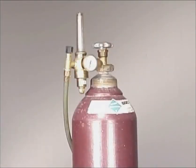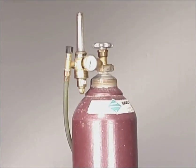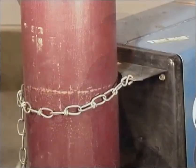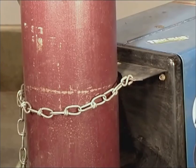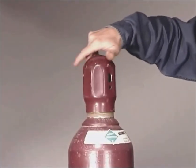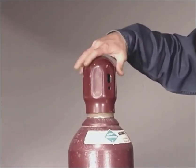Last is the shielding gas bottle and flow meter. This is a high pressure bottle and can be filled to over 2,000 lbs per square inch. You need to protect the cylinder valve from getting damaged. When the bottle is in use, it needs to be chained up securely, and when it is not in use or you intend to move the bottle, always use the protective valve cover, even if the bottle is empty.